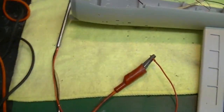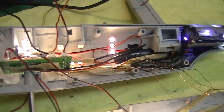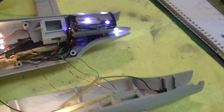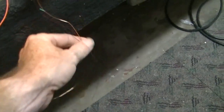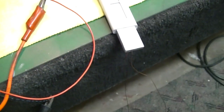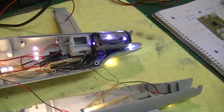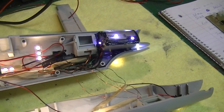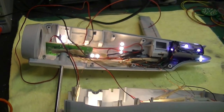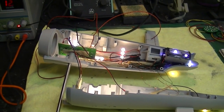We've got three wires coming out the bottom: red and black for the 12-volt power lighting everything inside, and a gold-colored magnet wire for our trigger — the separate push button on the base that controls the momentary switch for the Bussard speed. Everything's ready, so let's get this thing closed up. I'll come back and show you the model up on the stand all sealed up.